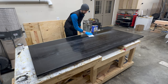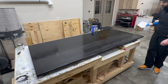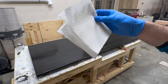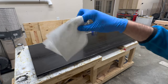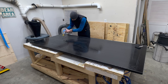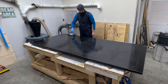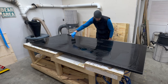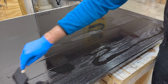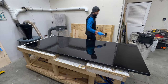Before we do the next coat of polyurethane, we need to clean the top off from all that sanding dust. I'm using mineral spirits on a paper towel here to clean the surface and wipe off all that dust. This is an important step — you can see how much dust is on the paper towel. Give the residual mineral spirits a little time to dry and completely disappear from the tabletop, then we are going to repeat the polyurethane step to build up additional coats before the final top coat.